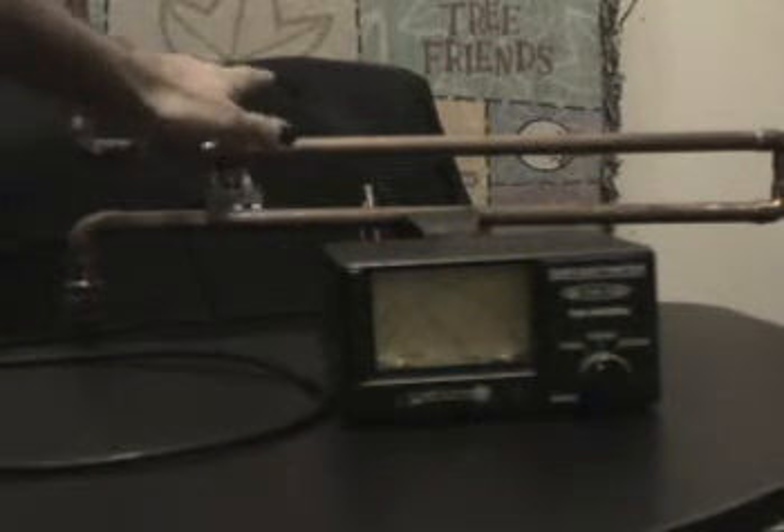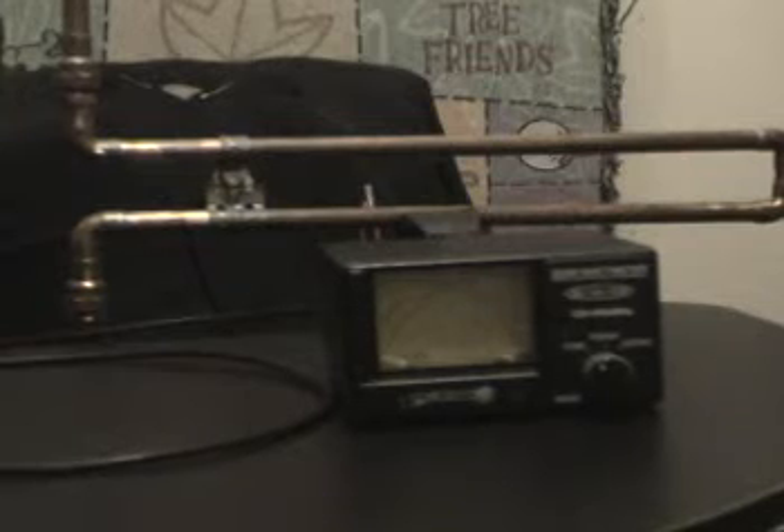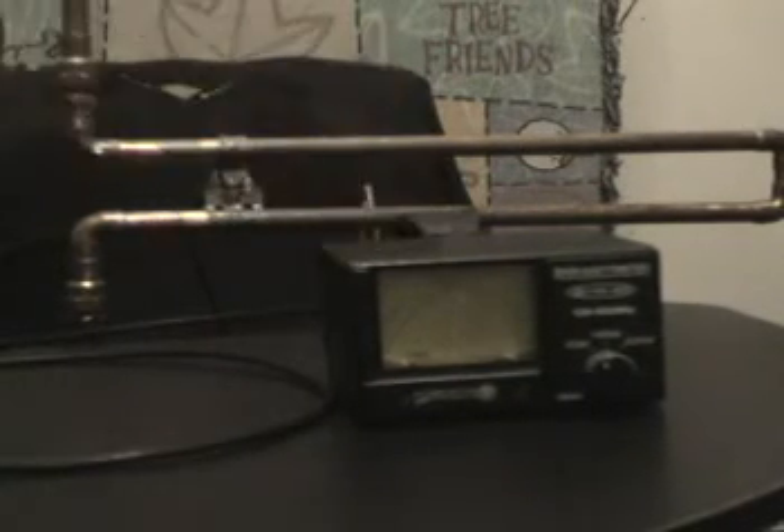Watch what happens when I actually get in the way of the antenna. Just your physical presence passing through the radio field emanating from the antenna is going to throw off the standing wave ratio. That's another cool thing about the double ZEP that makes it great for amateur radio emergency use or general use: not only can you change its resonant frequency by adjusting the position of the feed point and the standing wave ratio, but with a little elbow grease you can unscrew the elements and break it down into a relatively easy-to-carry portable antenna, making the double ZEP one of my favorite general-use radio antennas.